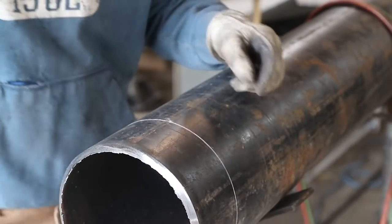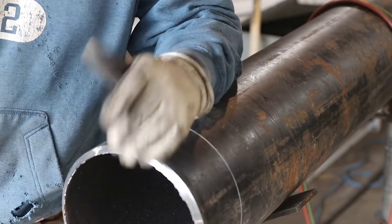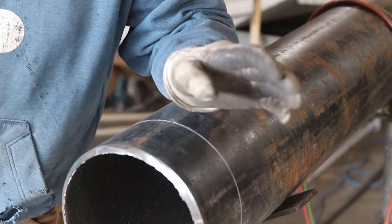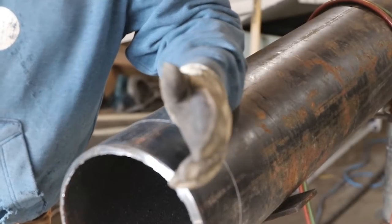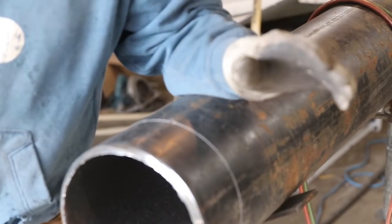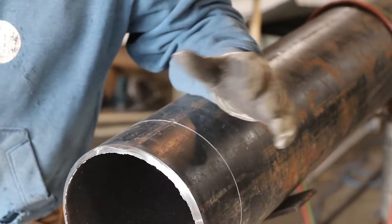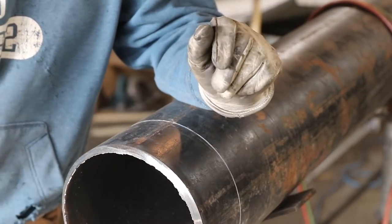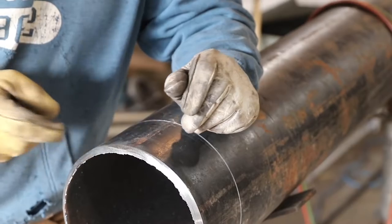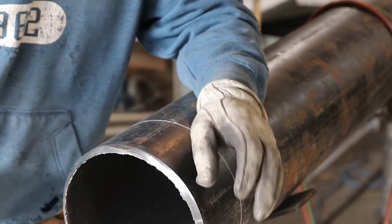Flat. Now, there will be a certain degree that you have to take this to. I don't know any welders that carry a set of gauges with them. The inspectors are usually the ones that carry them, and they'll check every now and then. I've probably seen a handful of inspectors check bevels. But I believe it's 37 degrees is what this needs to be kicked back to. If you guys are practicing, kick it back farther.